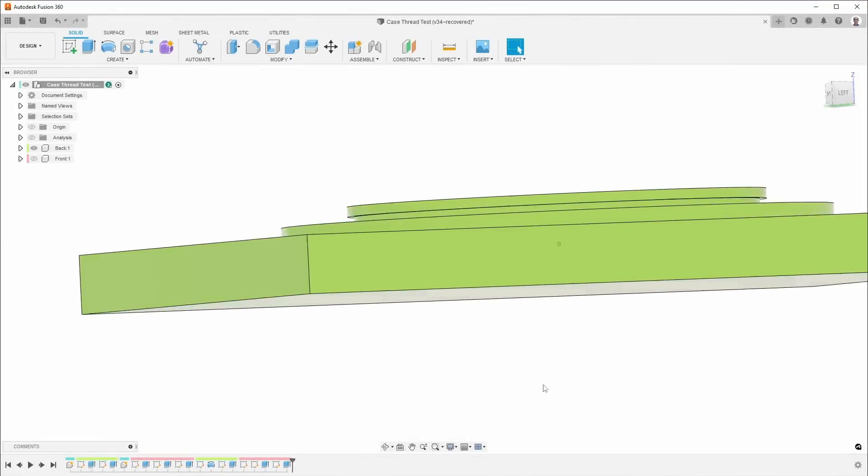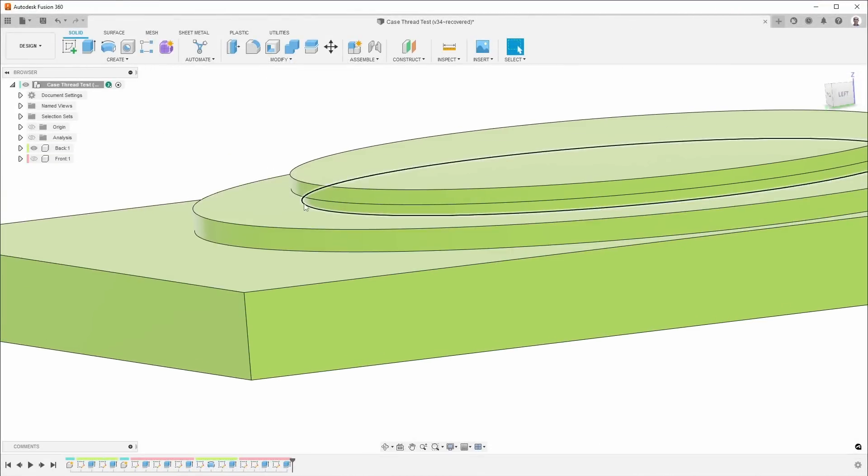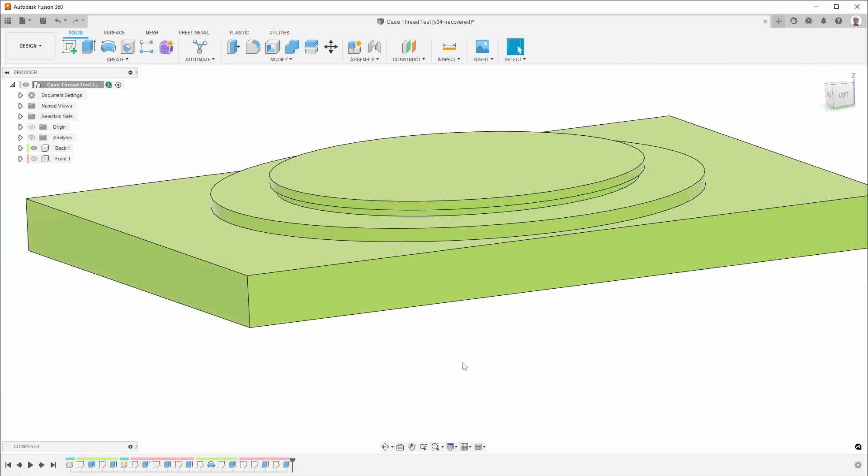The O-ring is going to fit into this area here, and the diameter of this is about 26mm. So I chose to use an O-ring with a cross-section of 0.7mm in diameter and an inside diameter of 26mm. I thought this would be 0% stretch, but I was wrong and I'll explain why later.